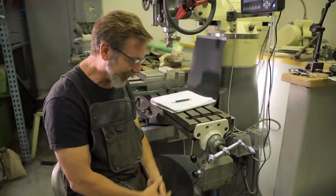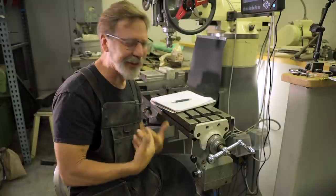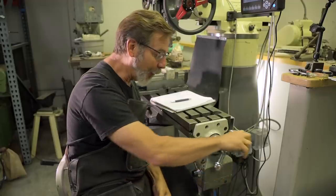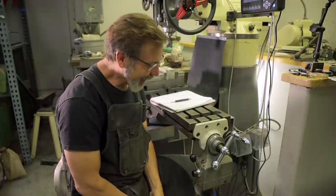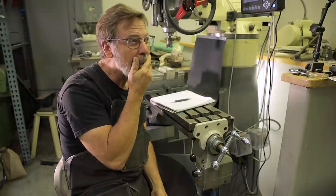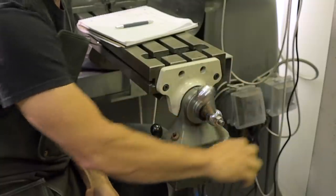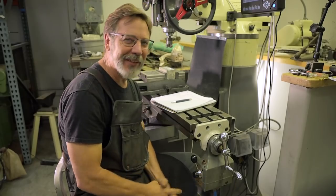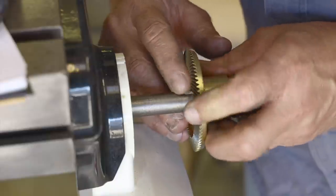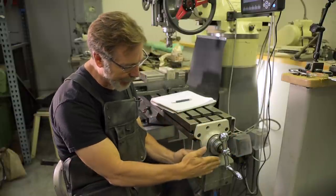It's now time to look at the Servo. This is a Servo 140 — 140 means for 140-pound tables. They also have a 160 and a 200, so the heavier your table, the bigger the servo you need. This is my personal favorite and the quality of it is excellent. It's an old one — I've had it for 10 years, and before that it was pretty old. I've had it on three or four different milling machines so it's been around the block. The gears are getting a little gravelly — they're straight gears, whereas the Chinese $100 version actually has conical gears which run a little smoother. I also like the form factor: it's a little bit narrower, though it does stick out about the same depth.